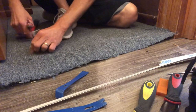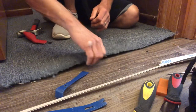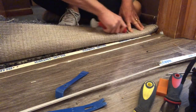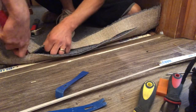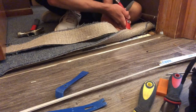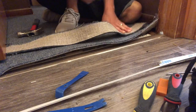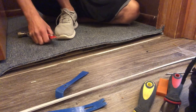We're going to flop that carpet over — I'm going to get some of the little strings. There's an indoor-outdoor carpet in here and the dogs had a field day pulling the loops, so keep that in mind. Next, we're going to take a razor sharp blade and cut back the carpet so we can get ready to transition right to that new reducer. We only want about an inch of extra material overlapping the reducer — anything more than that is just going to get in our way and cause issues.